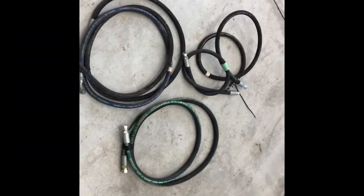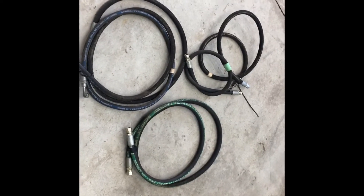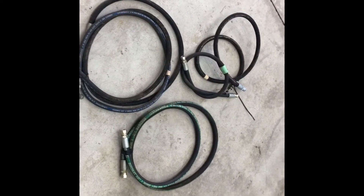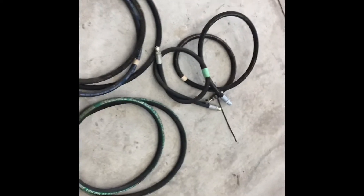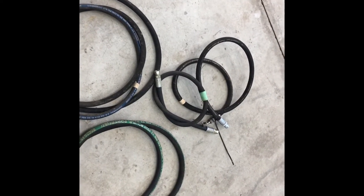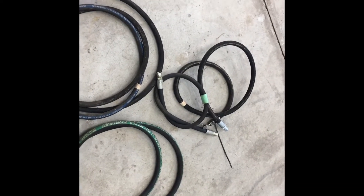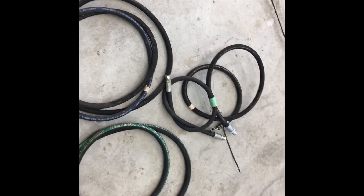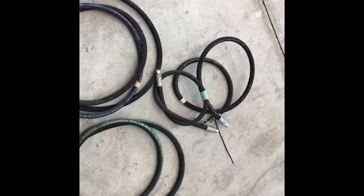In terms of measuring the hydraulic hoses, I found that the only way you can really determine the correct length is to use a piece of hose to estimate how long it needs to be and then take a measurement of that. It works to a degree. The point of fault with that is that if you use a regular garden hose or something, it does not reproduce the bend radius of a hydraulic hose. A one-wire hose is going to have a pretty stiff bend radius.